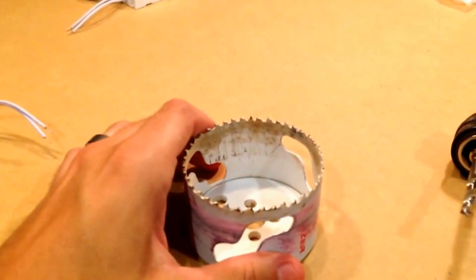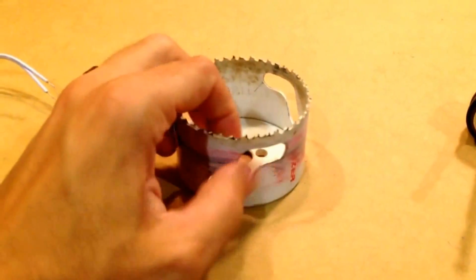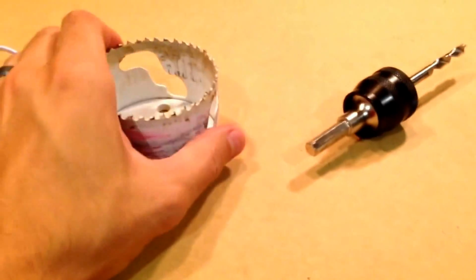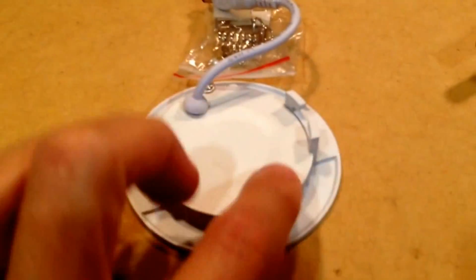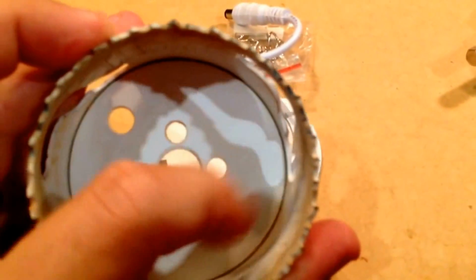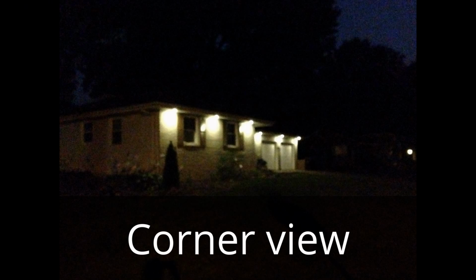And this is simply a hole saw. The hole saw is a 3-inch hole saw, Milwaukee, with a big opening to eject the plug. If you have these, they're great. This one, I didn't have a 3-inch, but just go to Home Depot, whatever, it's $13 to $15. This fits perfectly over this hole, and I wanted a little bit more room, so I made it the outside diameter, so that the hole is a little bit smaller, but I want a little bit more leeway in case something went.